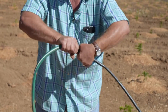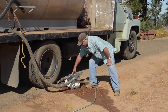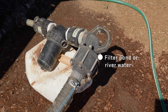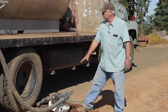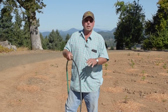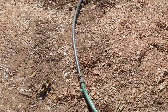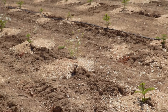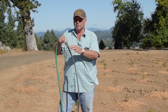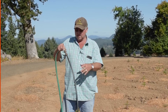If you're running off of river water or pond water, you'll want to have a filter system. We were getting some algae and that was plugging up our drip system lines, so that's a quick and simple fix. When you buy the drip system, it'll come in a big roll and you'll have to buy the ends to splice them together or attach to a garden hose. All of our fields are different lengths, so there's a coupler that lets me add more length to the lines if I need to.